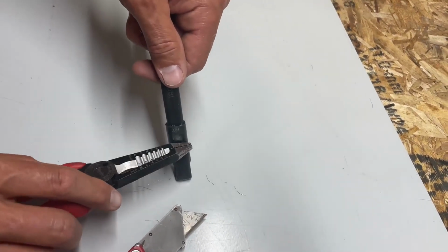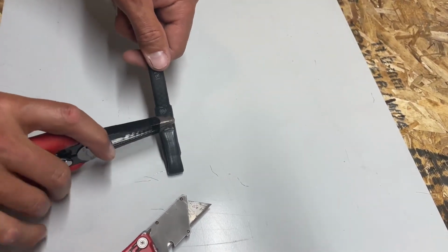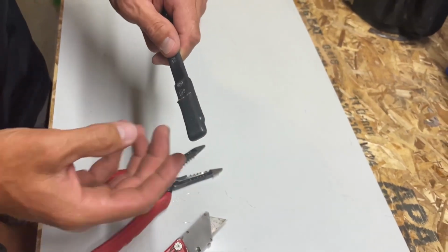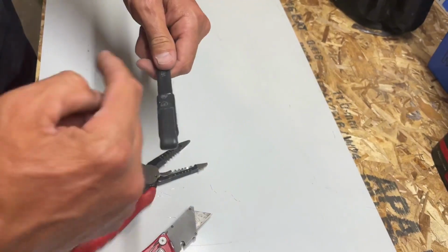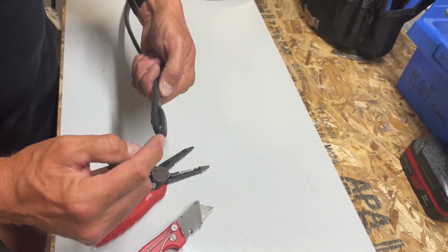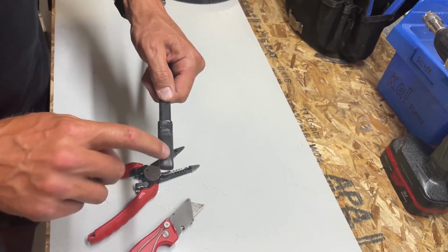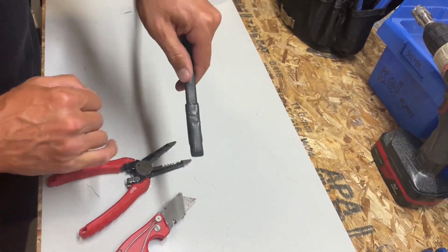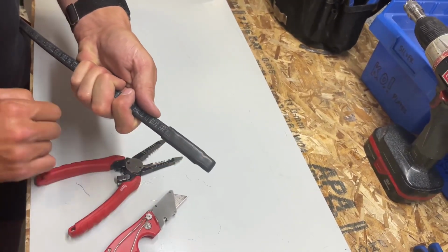And then I push that glue against the main sleeve of heat shrink right there, allowing it to hold in place. If you don't get glue that's holding that in place, you can wrap some electrical tape around that, holding that down. But this is your sealed point right here. Having that fold over, it prevents anything from coming down. You got a lot of glue in this sleeve, so that nothing's going to come in here. And as long as you have this sealed up with glue right here, this is a good seal right here.